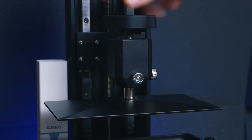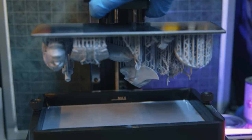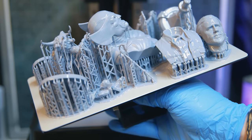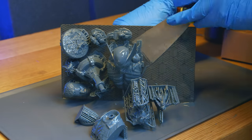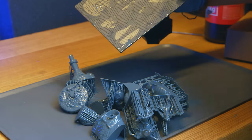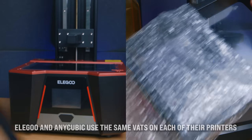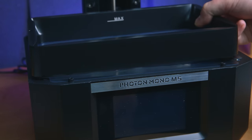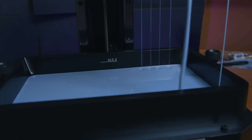The build plates on the different models are the same for the printers from each brand. Anycubic uses a smooth sandblasted build surface and Elegoo has a laser etched plate. I've had no adhesion issues from either, but the Elegoo style takes my personal preference because the laser etching has historically shown much better plate adhesion, without being so deeply engraved that prints are hard to remove — it's super easy. Now before I move on to levelling, I want to look at the VAT. The M5 VAT is much deeper than Elegoo's, and this is where Anycubic clearly takes the win. With larger printers it's common to print larger things, so being able to put more resin in the VAT is just a tad more helpful.